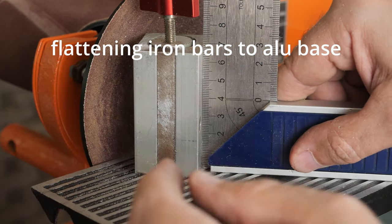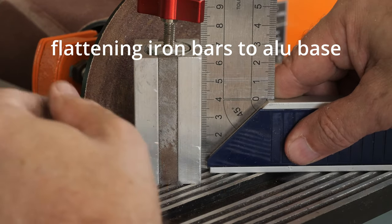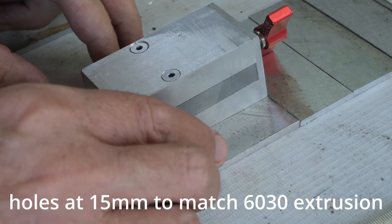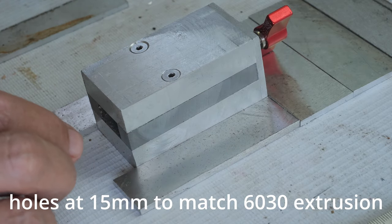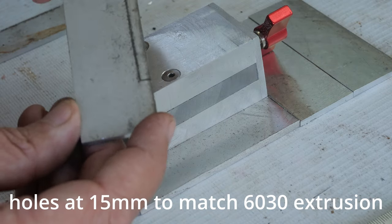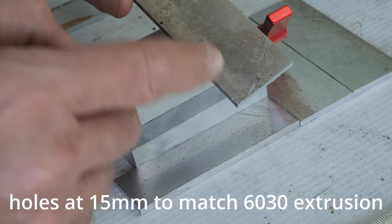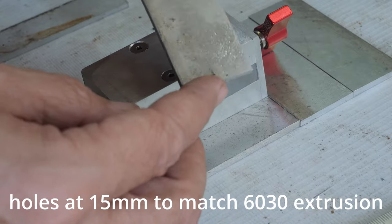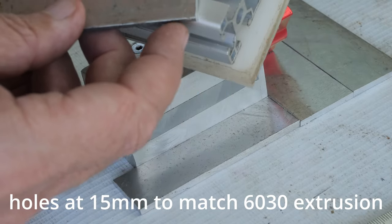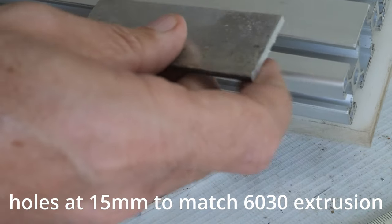Okay. So the final step to build our switchable magnets is to attach wings. I call them wings. It's a piece of aluminum, 30 millimeters by 83. So I will drill the holes here that match the extrusion slot,